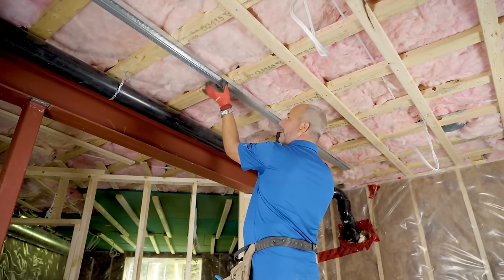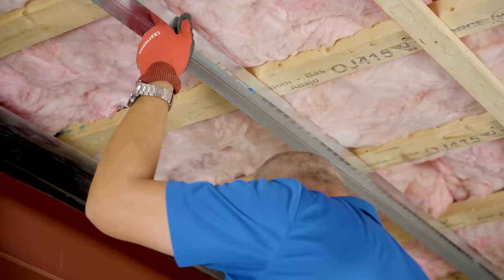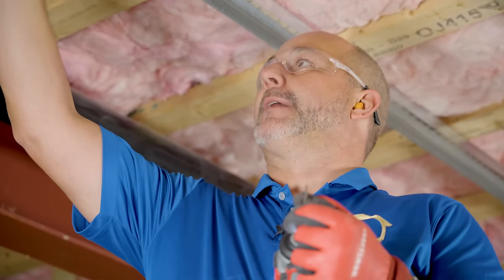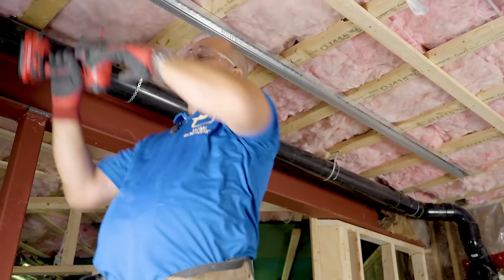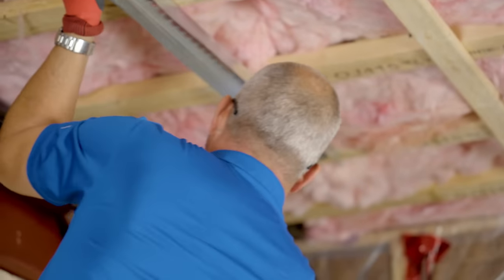I want to get right on my red line. The reason I do that is that one little dent is all it takes so that my screw isn't running around when I'm trying to put it through. When you're building a box like this, we're not building structure — we don't have to carry a lot of weight, we only have to carry drywall. So one screw for every joist is plenty. We'll go all the way to the other end, and that'll make sure the rest of this stays straight while I throw the screws in.